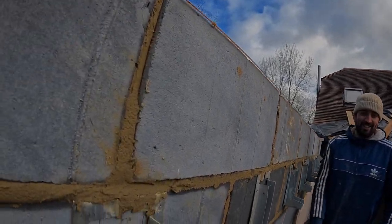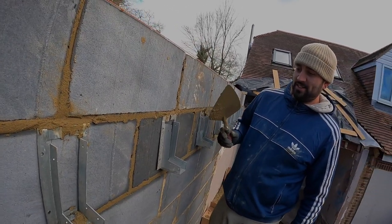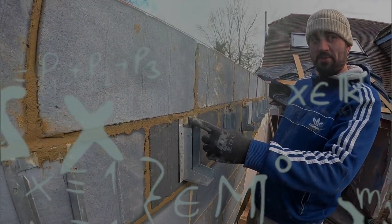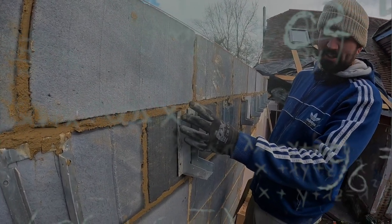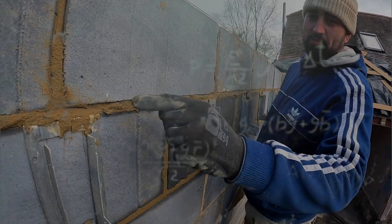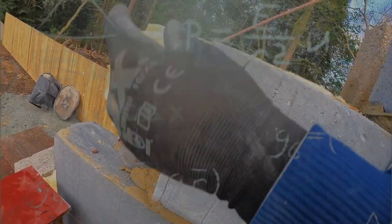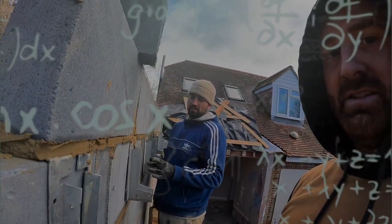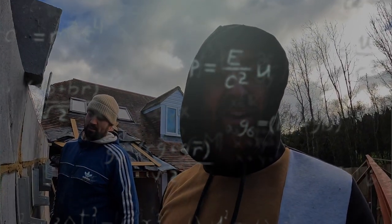A little bit of education from Master Charlie — he's going to show us how to put hangers in the correct position. So when you start off, you've got to measure 1,200 from your starting reveal. 1,200 in. Because plasterboard walls have to be 1,200 mil centred. Work your hanger to the centre of that line, then work the hangers back into the corner, and these ones are measured 350 apart, so they'll still be all right. In the corner you just have to add another one in there, because if you measured out 350 from the corner coming out this way, when you get to the edge of the plasterboard, that won't work out at the hangers. Look at that — a bit of education.